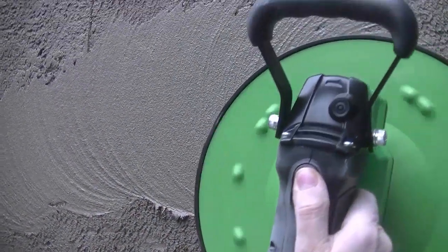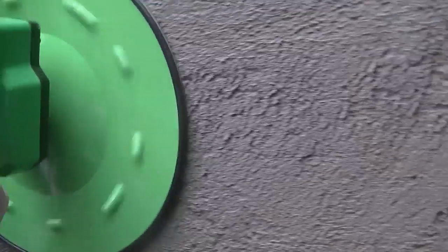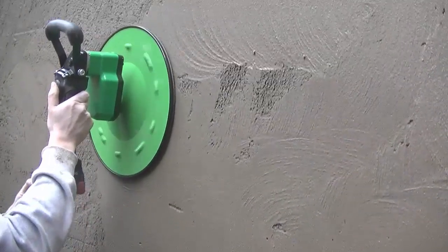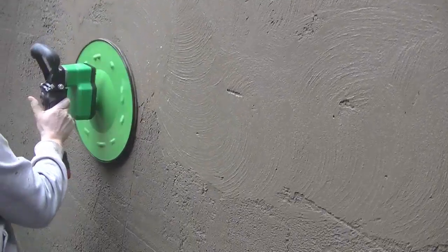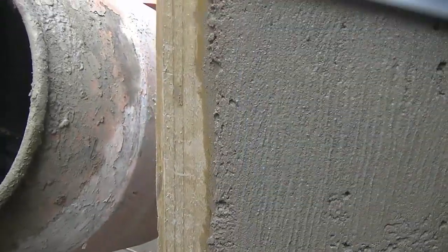The mistakes were from me going too early — I was trying to beat the light and the temperatures were only going to get colder. I did enjoy the sponge attachment on the float itself. This is a cordless Refina power float, which to me is better just for the fact that there's no wire trailing about and needing electric. Technically I could go on site with four charged batteries and surely get a full gable rubbed up. And the beauty about that is going up and down stepladders — you've no wire to trip over, no wire to get caught around the ladders, tangled or pulled out of the lead.